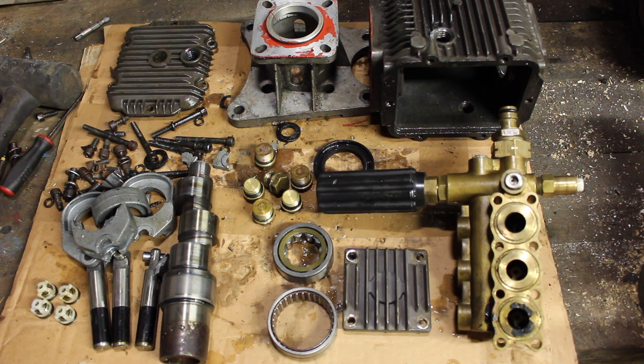So that's what one of these pumps looks like when it's taken apart. They're a reasonably straightforward pump with basic principles to understand. They are serviceable in that the valves are replaceable, and I'm sure the seals and bearings are as well if you really wanted to. The main thing maintenance-wise is to keep the correct level and viscosity of oil in them, make sure the water is fully filtered before entering the pump, and also that the unloader valve is working so it's not putting too much pressure and causing too much heat within the pump, which can cause wear.